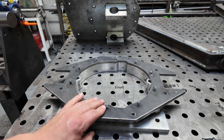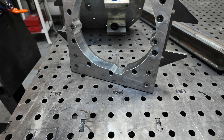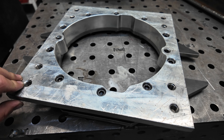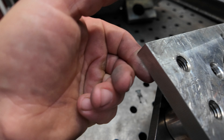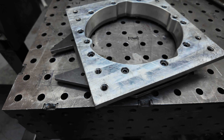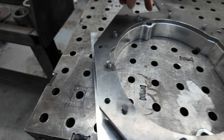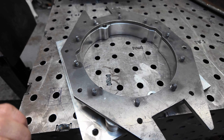This is the face plate for my off-road housing — I just left it on here because we were starting to tinker with it. This is the block of aluminum I bought to machine. You can see the ring gear cutout lines up, giving you all these matching features to make sure you put it together right. You can see how thick this whole thing is — this big heavy-duty half-inch thick flange, all the threaded inserts so if you booger one up you can just thread a new insert in. All countersunk Allen bolts — every single bolt hole on this face plate is clamped tight to this perfectly machined flat unit, pulling heat out to help keep the face plate flat.